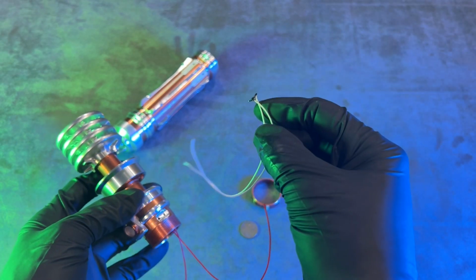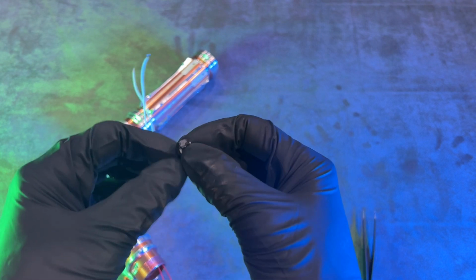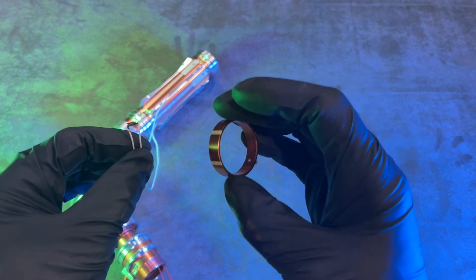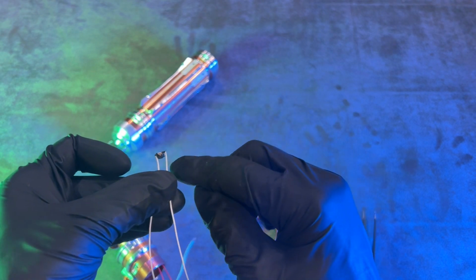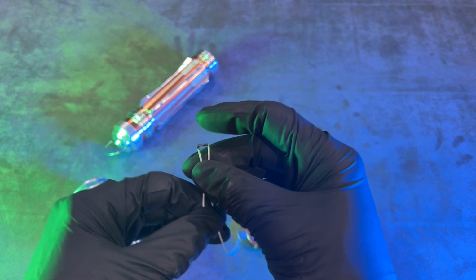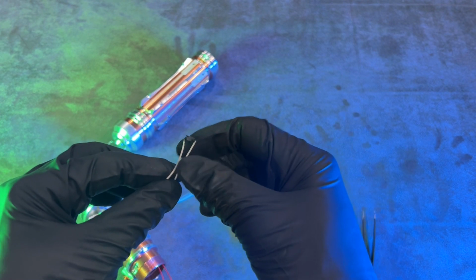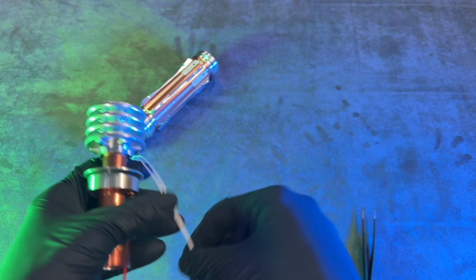It's going to be the same exact switch, but now I wired it actually upside down. I find it easier to wire the switch upside down because the small button inside the shroud is easier to hit with this wide area than that little brass section. I wired it with the tabs down, and I put some liquid electrical tape on there so it doesn't arc out. And this one's fairly simple too. We just put our wires in this way.